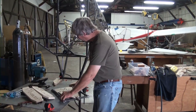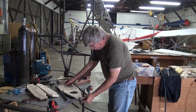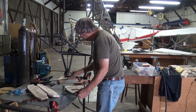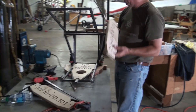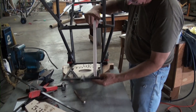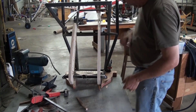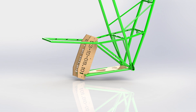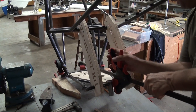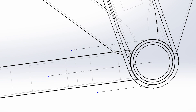We'll clamp them back in place, and the tube should be facing so that the cutout is on the bottom side — this will fit right up against the axle like that. These pieces are simply made to fit onto here, pop down in place, and hold the gear like that. Those are perfectly positioned at this point. We will then take this and fit it up against the axle tube; the landing gear box sub-assembly should be centered on the axle tube.